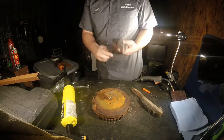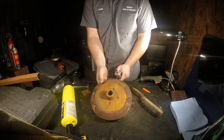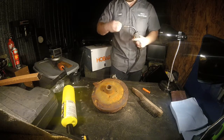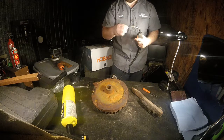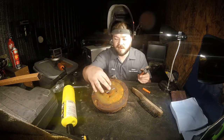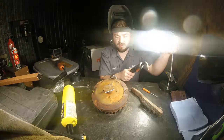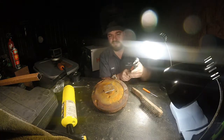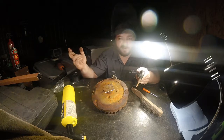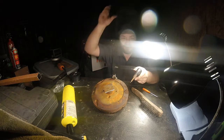Welding is completing a circuit. You can't complete a circuit without the other side of the circuit. That might actually give me a better angle to look at it. I have not used this brand of welding wire before either. Well, I have, because this is what the welder shipped with, but I haven't used it in a long time since I found the Lincoln Innershield. That stuff works great, but nobody locally sells it, and I don't want to wait for it, so I got the Hobart wire. Should be able to do it this time, unless that's too much rust for the ground.